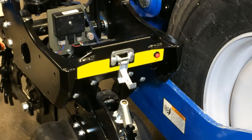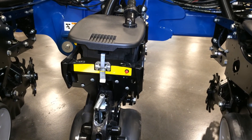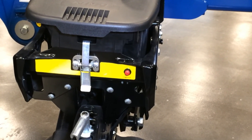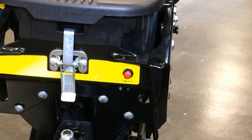A really neat feature of the 4900 series planter is the little red button that everyone asks about on each row unit. By pushing the red button, we can make the seed meter run and drop seed, make our fertilizer on that row drop into the furrow, and also make our insecticide meter disperse insecticide. This is used mainly as a technique to make sure everything is working properly on a row by row basis.